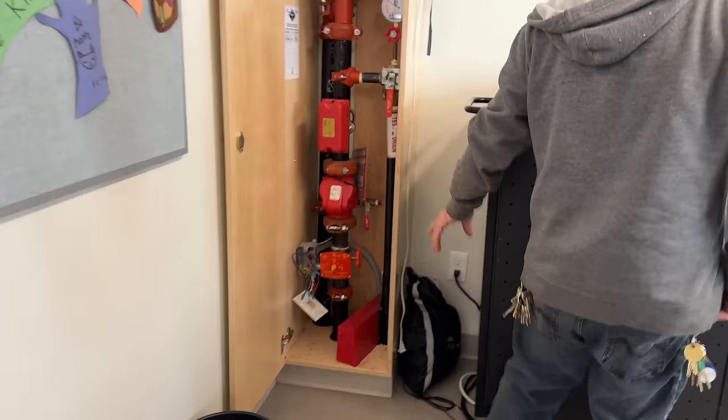So the bells were run off the auxiliary power, not the main rail of the power supply, and we switched it to the main rail, hit drill, and just as we hit drill and the horns pulsed for 1 second, the entire panel went down. Just killed the whole thing.